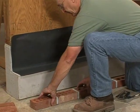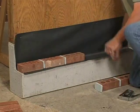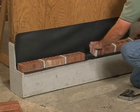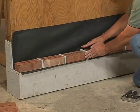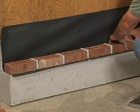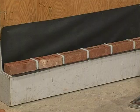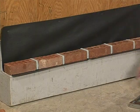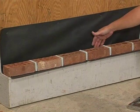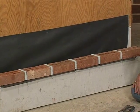I'll set a few brick up here on top just to simulate what you might see on the job site. You'll notice at this point that I do have several very important features in place as far as brick veneer is concerned: one, the through-wall flashing, and also the airspace behind the veneer. That one inch airspace is very important.